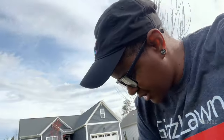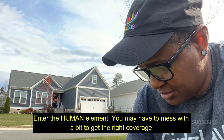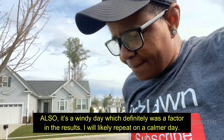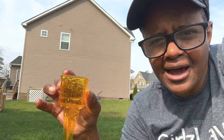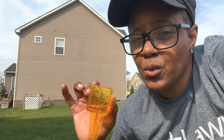Let's check the other primary — this one, not so much. There's nothing in here, so obviously there would need to be an adjustment. It seemed to have been hitting that spot a lot more. The last one on the outskirts — same situation, nothing. For the secondary cups, the first check is basically nothing. But this last one was closest to the sprinkler and it accumulated almost an inch in 15 minutes. So when I place these cups I'm going to have to really pay attention to the location and the spray as far as where I'm trying to actually hit. But I do know it looks like we can get an inch out of this sprinkler within 15 minutes.